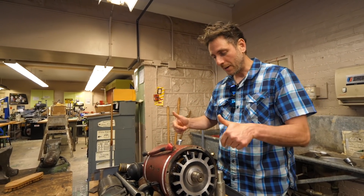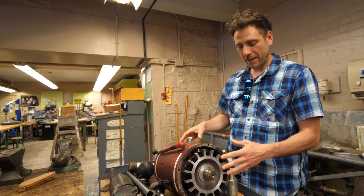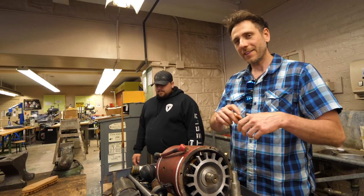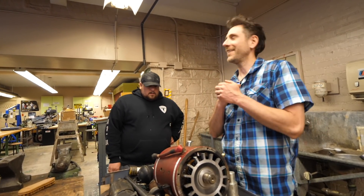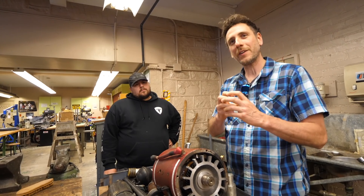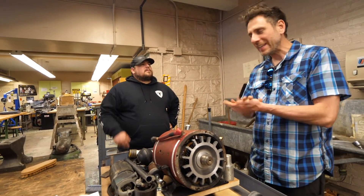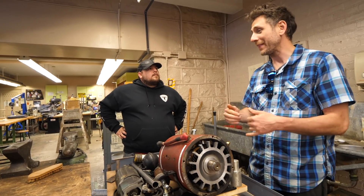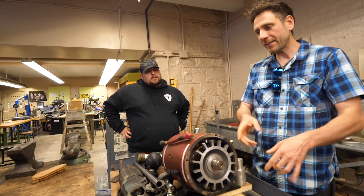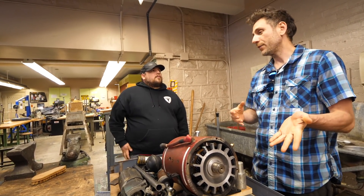He said 1,100 pounds of torque. Wow. So the theory is that it spun past its RPM rating, the coils exploded and then it seized. First it sheared the key, and then that gouged itself and latched on there — and then that's when it ripped it off. So the key is what's supposed to break under stuff like that. What happened was the key did break but then it's like a two-event process.